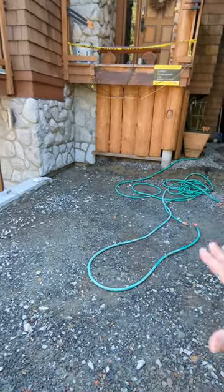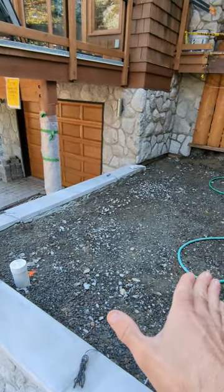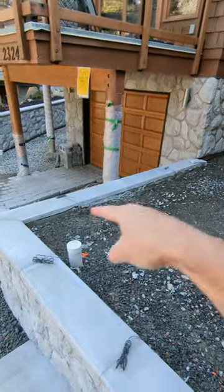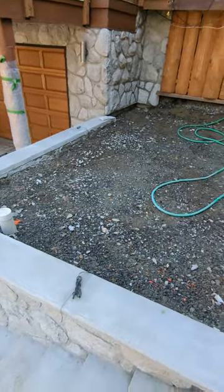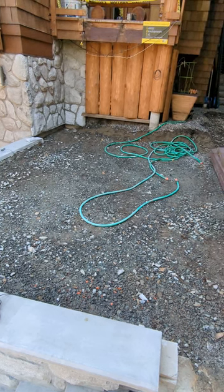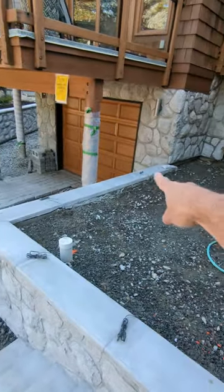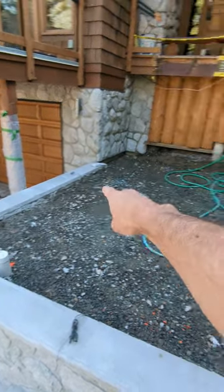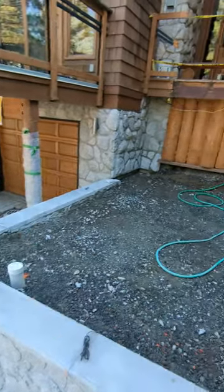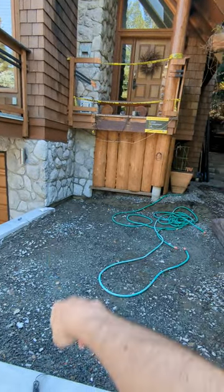We should be grading everything this way. Ideally the water is falling off of that wall, but that's going to be tricky because this whole thing is flat. We'll need your help figuring that out because we're going to have to be level across here because of the step. Ideally our high point is over there and we're draining this way — that would be optimal. They're going to build new stairs with stringers down here, sitting right on our pavers in this area.